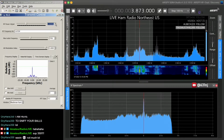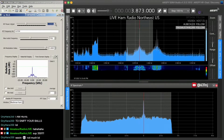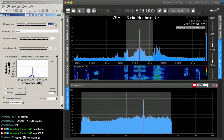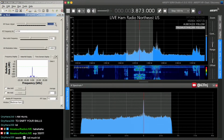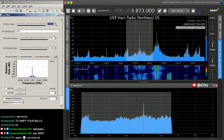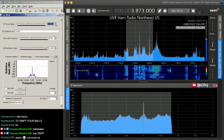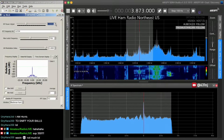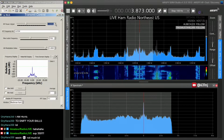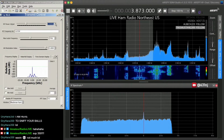Oh, do you have the HF Plus? Yes. Loading it, you have to have C++ installed. If you allow the program to load it, I ended up with problems. I had to go back, rip it out, install C++, and then load the software, and it worked perfectly after that. I had some lockups, but it had to do with the SDR gain overwhelming the code. It just lost its mind when you run too much gain in the front end of the SDR. And they warn you about that. It's actually in the software help menus.